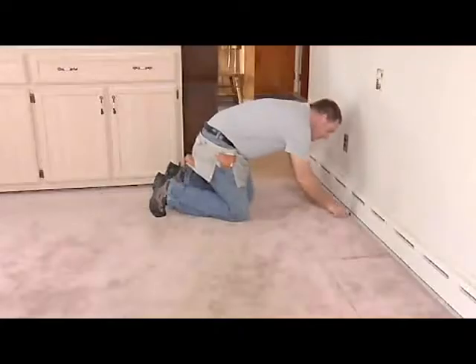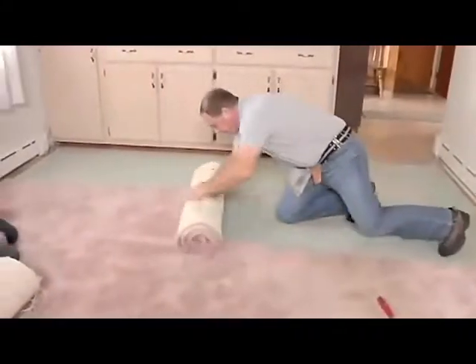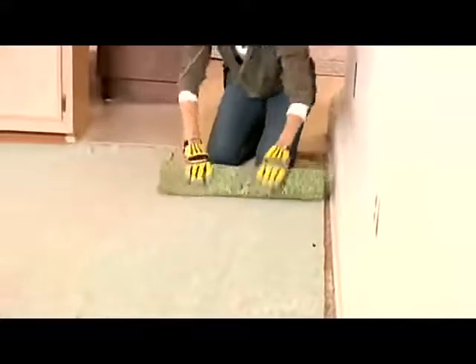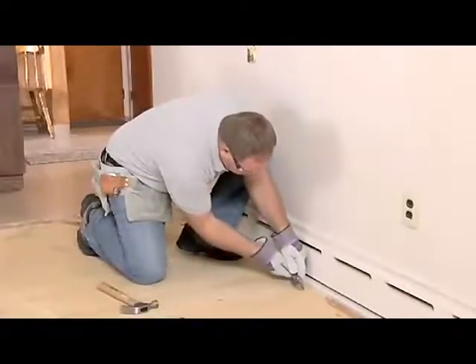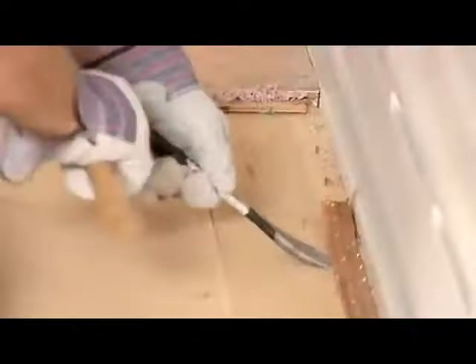Now it's time to get the subfloor ready. For this demonstration, we'll show you how to prepare a carpeted, suspended wood floor. If you don't have this type of subfloor, you can still use the subfloor preparation steps with a few modifications. First, get your utility knife. Removing the carpet and pad is more involved than you might think. To make it easier, cut the carpet into three to four foot strips. Once that's up, do the same with the carpet pad. Since the pad is stapled, it won't come up in nice even strips. Cut the strips as best you can. Next, use your pliers to remove all the pad staples. The last thing to come up is the tack strip — use your work gloves, as the tack strips are sharp. Make sure you pull up all the nails that were holding the tack strip down.